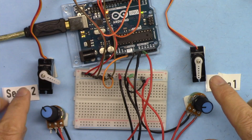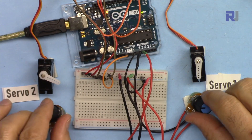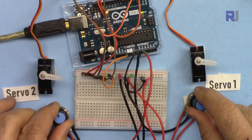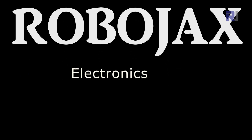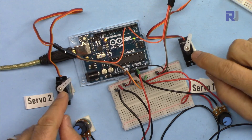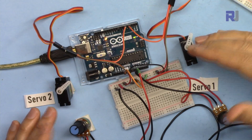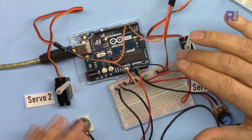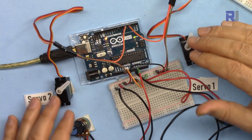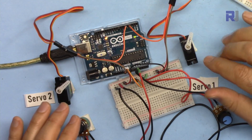In this lecture we are going to learn how you can control two or more servo motors using two potentiometers with Arduino. You will have independent control for servo one or servo two. I've seen comments asking to control more than one servo motor, so here I'm going to show you how to control two or up to six servo motors with Arduino Uno, and with Arduino Mega you can do more. You can control as many as the analog inputs of your Arduino will allow.